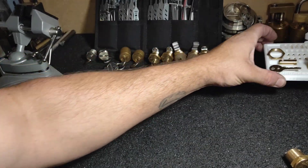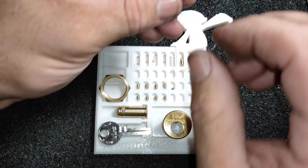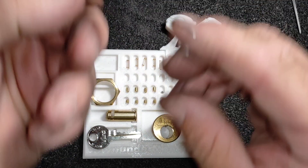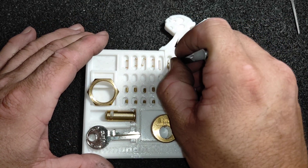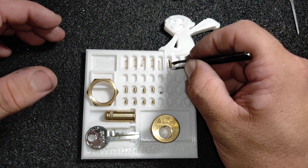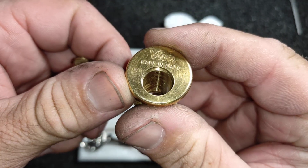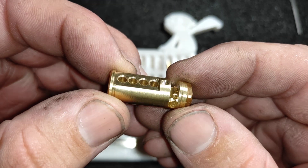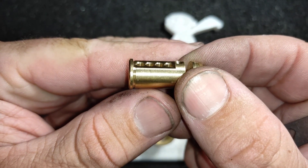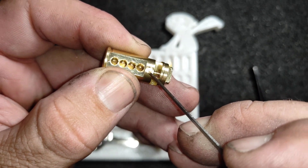Right, pull over the pinning tray - I already got one apart to save a bit of time. In the back you've got a press-fit pin. I drilled it out and pulled it out. Inside was very, very interesting. I'll show you the core first - there's nothing wrong with this, this is just normal standard. But this one was a little different: there's a massive flattened-off section just here. Compared to a normal core, there's a big flat cutout section there.